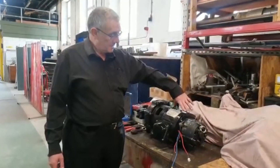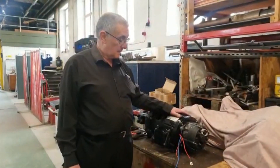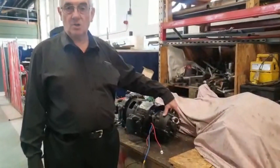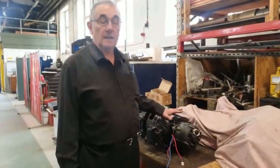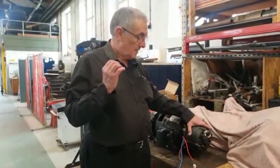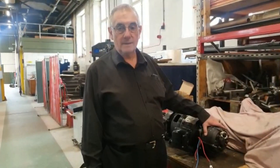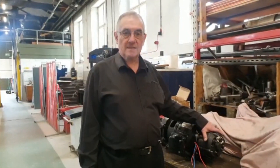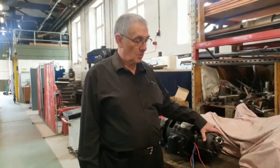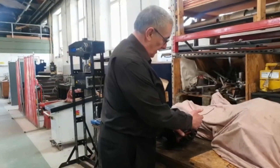Originally this area contained a dynamo, that's a DC generator with a capacity of 500 watts. But Mining and Locomotive Works in the 1990s developed a modification which involved fitting a Bosch truck alternator instead of the dynamo inside the casing, which put the rating up from 500 watts to 900 watts, but has also made maintenance much easier. If we get a problem with the alternator we simply swap it for another one, and we can take it to our local automotive electrics place and they will provide an overhauled replacement for a very reasonable sum compared with having to overhaul the original DC type generator.